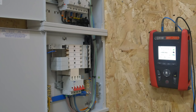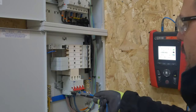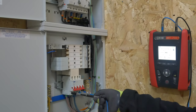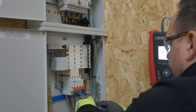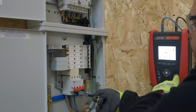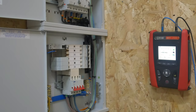So our next one is L1 to L3. Probes in — you will have popped some gloves on, although it's a dead test it is still applying voltage, so cover the basics off. I hate to see people working inside boards where there is electrical energy without gloves at the very least. You can see we're clear again, off the scale. And if we check L2 to L3 — that's the two middle ones in this case — hit test, and again we're off the scale, which is nice.